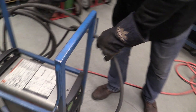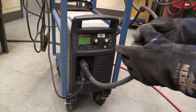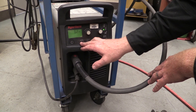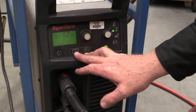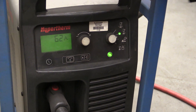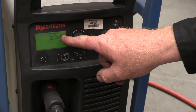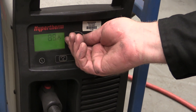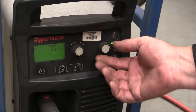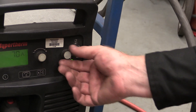If we come around to the front of the machine, we can see it's powered up. Now there are a couple of different settings on this machine. There are settings for air pressure or gas, because we can also put a portable compressed air tank on this instead of an air hose. There is our dial for amperage — the big A. This one goes up to 85 amps.